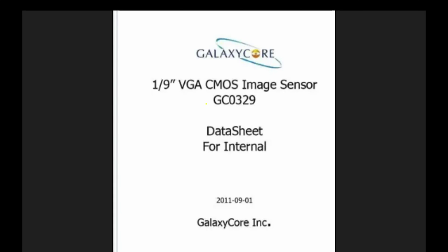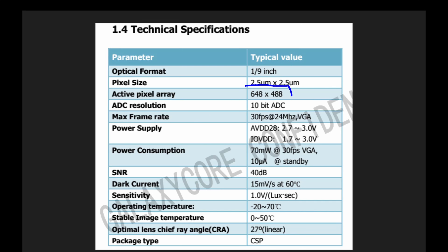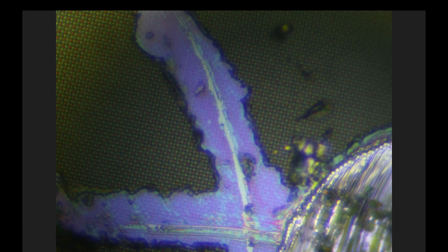The part number draws me to what appears to be a datasheet: GC0329, Galaxy Core. When I look at the actual datasheet, this is a VGA imager — it's 640x480. And when I look at the pictures I got out of the camera, I was only able to get VGA-quality pictures. You can see a lot of artifacts when you zoom in, which is typical of a modest-resolution photograph. The reason it baffles me is that when I bought it, it said a 1080p HD camera. I have strong suspicions that is a bit of an exaggeration. If anyone has one of these and actually got 1080p, I would certainly like to hear from you. Everything I'm seeing points toward this being more of a VGA imager.